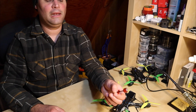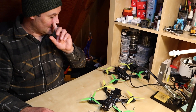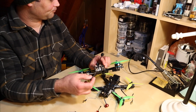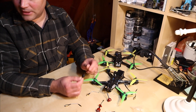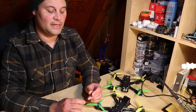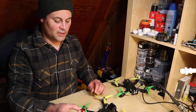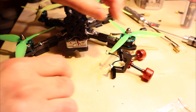You might ask why I don't just use the DJI cable and DJI antennas. Two reasons: the price is great — two cables for $15, two antennas for $15 — but it's heavy. A full SMA connector plus the antenna adds about 10 grams each, so 20 grams total just for the antenna setup. I don't want that kind of weight. The other reason is that the caps on the DJI antennas have been coming off, so I'm having a hard time trusting them.